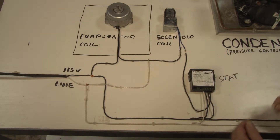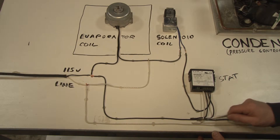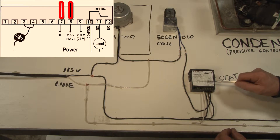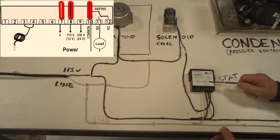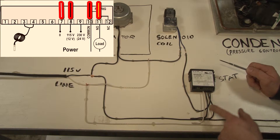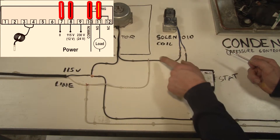I'm going to give it a once over real quick. Here's our 115 volt line which consists of a hot and a neutral. Terminal 7 is connected to our neutral. Terminal 8 is connected to our hot. Terminal 10 is our control circuit common, which is also connected to our hot. And terminal 11, which is our normally open control circuit, goes directly to our solenoid valve.